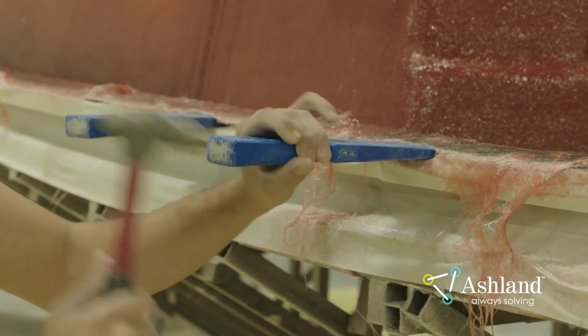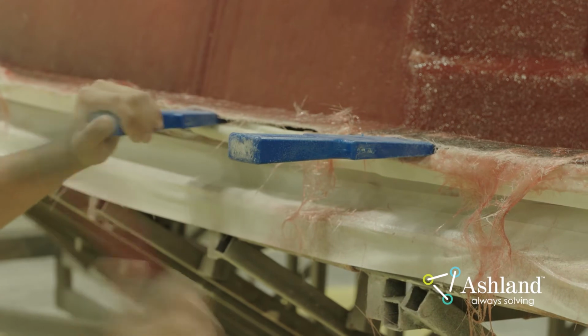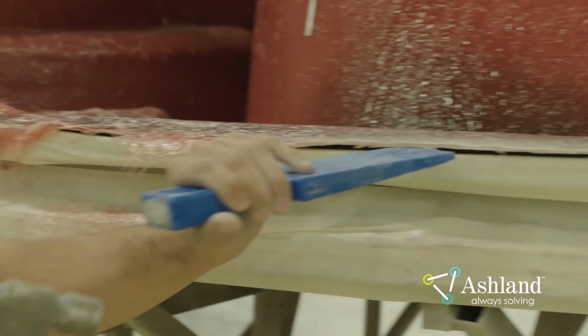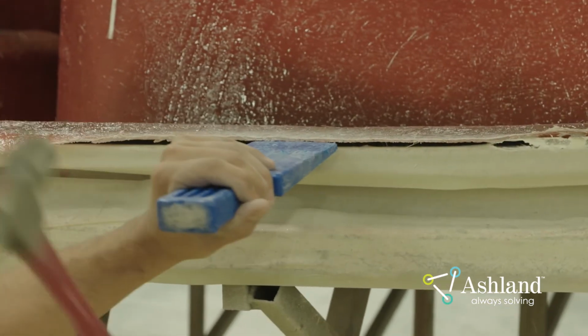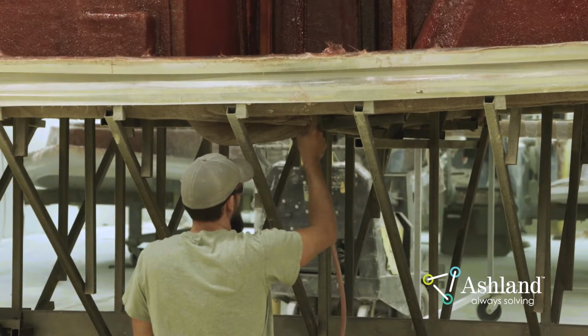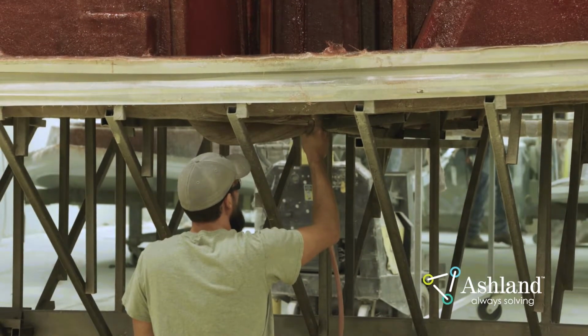from the mold. Avoid using metal tools during demold, as they can damage the part and the mold. Be careful not to flex more than necessary, as this can cause damage to the mold and the part. With the wedge in place, use regulated air pressure to blow air between the open space between the mold and the part to help break it loose.